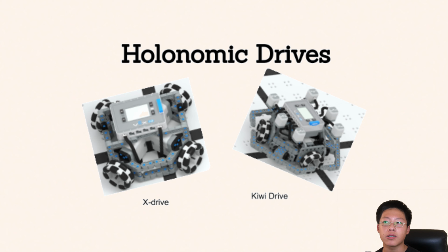The third type of movement we'll talk about is non-cardinal movement. Non-cardinal just means a robot can move in directions that are not forward, backwards, or sideways. For example, some robots can move diagonally or even at an angle of 30 or 60 degrees. Robots that can perform these movements are called holonomic drives.